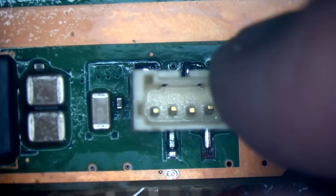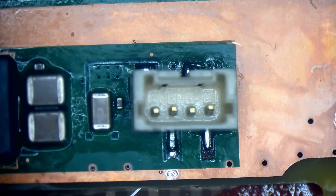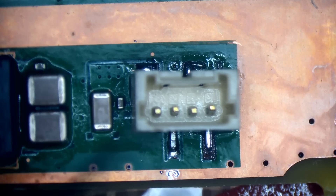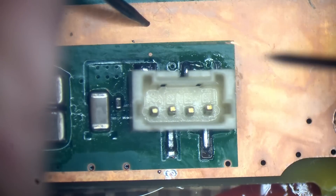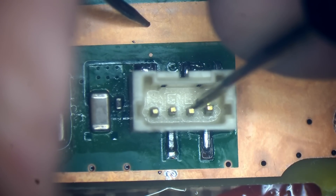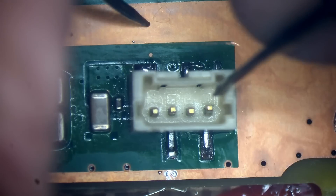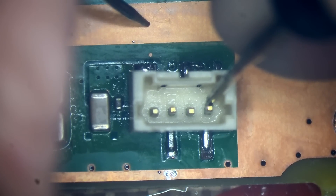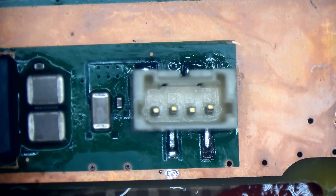Before I start to secure anything, I'm just going to test these pins with the multimeter to make sure they're all good. I'm in diode mode with the red probe on ground. We get a beep — 0.65, so that's good. That's ground — good. This one's not going to beep because it's a high reading: 1.37 volt drop to ground — that's good. And we've got 1.04 volt drop to ground on that one. So we've got contact on all of those pins — all good.